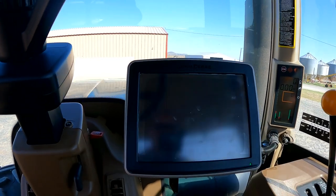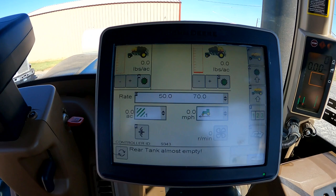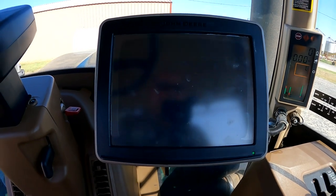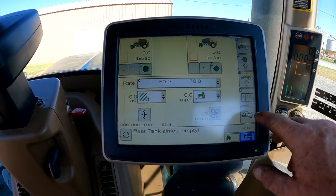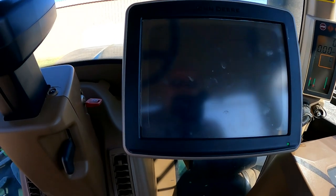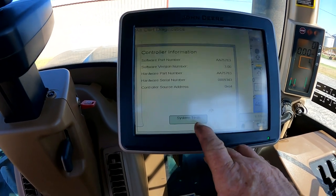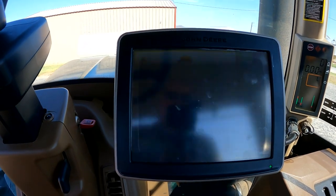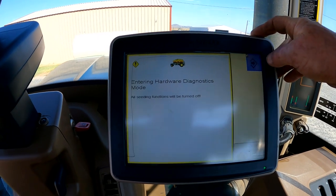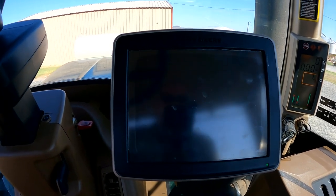We're up in the tractor now. We'll get our main drill page up so we can look at diagnostics. We're on our main drill page here — we'll go down to J on the right and click on our diagnostic icon, which looks like a book and a wrench. It says 'Controller Identification' and we want to do 'System Test.' We'll acknowledge that we're entering into diagnostic mode.